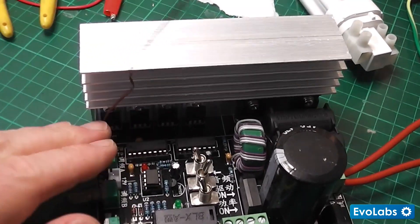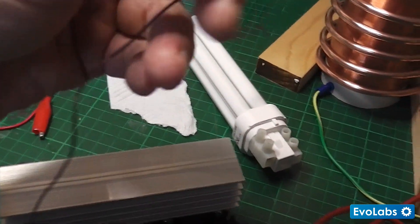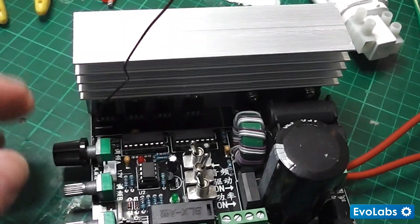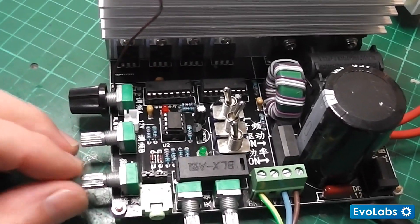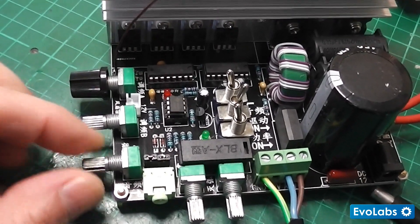To achieve that, at least on the secondary side, you have this antenna wire, which obviously would want to be in reasonable proximity to the secondary coil. So you tune it via these two pots and also via the output frequency on this pot.